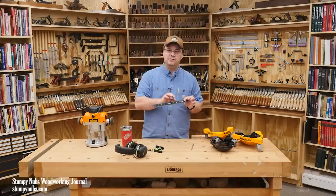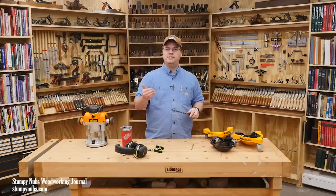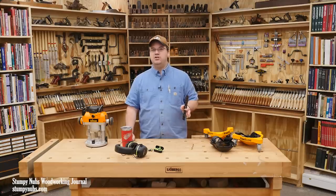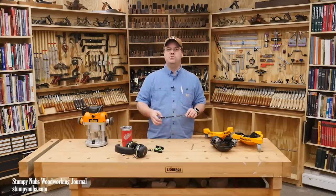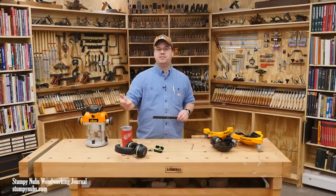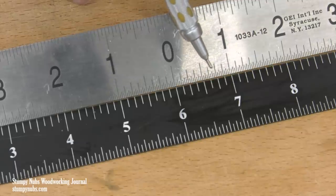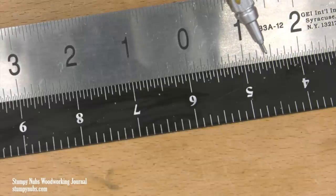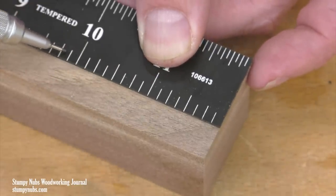Another important feature is the scales — there are no 32nds. One side is 16ths, the other is 8ths. Now ask yourself: do you really use 32nds for most woodworking projects? I'm not saying you only measure to the nearest 8th. What I mean is, do you lay something out that is like 22/32nds? Most often you're using 8ths — like quarter, 3/8ths, half, 5/8ths, 3/4 — and sometimes 16ths like 5/16ths or 11/16ths. My point is, I like a scale that is as uncluttered as possible. If there are fewer marks you're not going to use anyway, it's faster and more accurate and you'll make fewer mistakes.